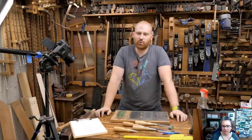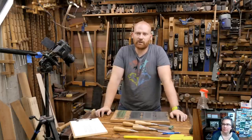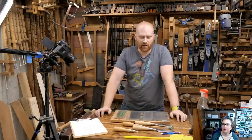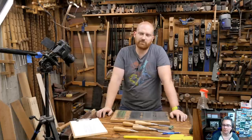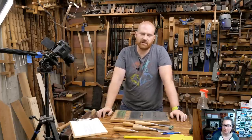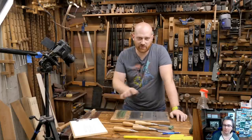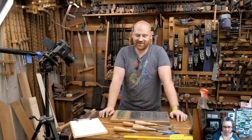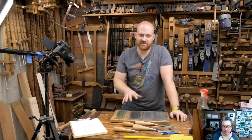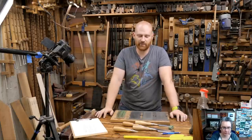And if I'm cutting mortises that are, let's say, 1/4 inch by 2 inch by 2 inch deep, I'm probably going to do two of those, and then I'll come back and sharpen again. And I'll do two of those, and I'll come back and sharpen again. I could probably stretch it out and go a little bit longer, but I find that to be about the worthwhile time-wise for it. And again, it really depends on your particular type of chisel. Some chisels are really durable, and some are not. So that's one of the things you have to look at. If you want to see the chisel test I did, where I actually compare them and show the durability difference between them, you can see how that comes out.